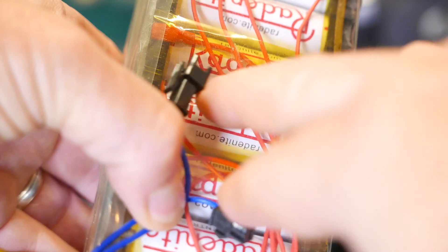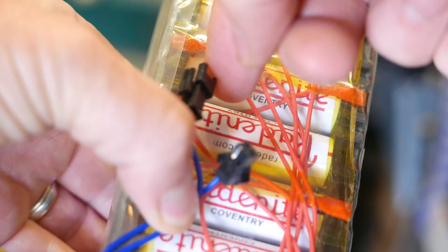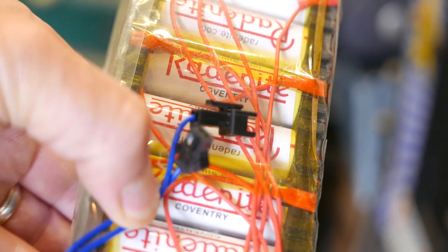Anyway, that chip is probably also powering your washing machine and your dishwasher. The boost button - let me explain that. Behind every murder is a motive, and behind every video I upload is a motive. The boost button: I've got a 1000 watt e-bike wheel, very similar to the one I fitted on a previous video. That was a 250 watt; this one is a 250 stroke 1000 watt. How cool is that? You switch between the two modes by connecting those two blue wires together or separating them, and that allows you to have a legally compliant e-bike here in Europe, but also you can have a switch which switches it back to 1000 watts.